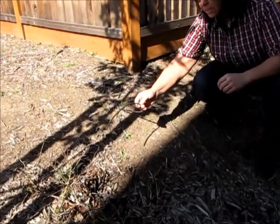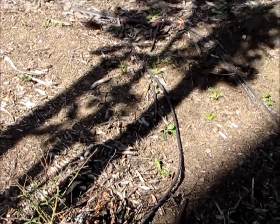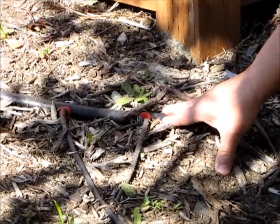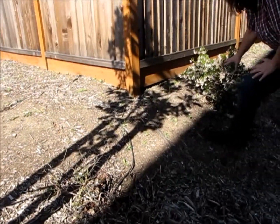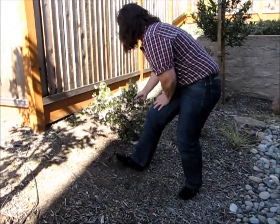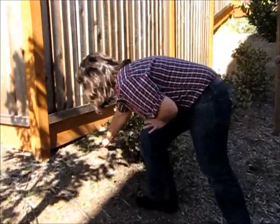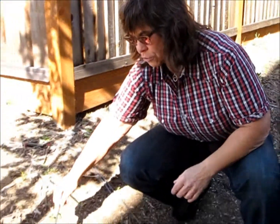When we look at existing drip systems, we find a lot of them that have been built using an excessive amount of this small 1/4-inch tubing we call spaghetti tubing. Here's an example of a way we're going to recommend you try and avoid building out your distribution system. Here's our 1/2-inch tubing up here. Where are our plants? Well, in this case, the ceanothus that's still dormant is a good 4 feet away. We've got a manzanita over here, beautiful, in bloom, and it does actually have the emitters. Well, it's a little closer, but look at the length of these 1/4-inch runs.